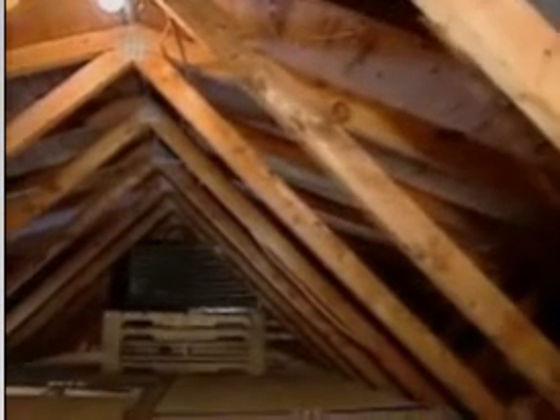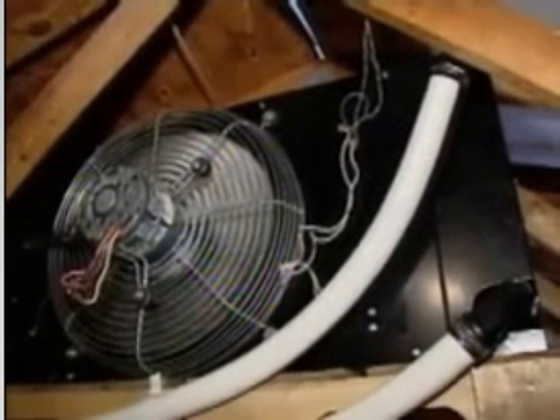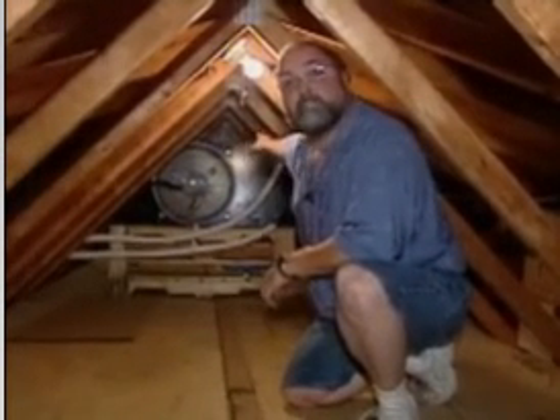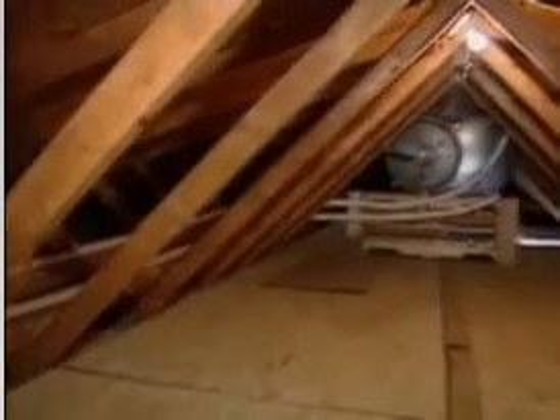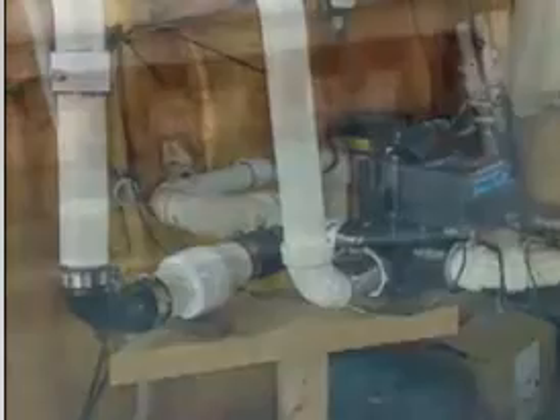So explain to me what the contraption is up in this attic — what does this thing do, how does it work? You're looking at the collecting unit right here. You've got a fan pulling towards us, which is pulling the heat from the other side across the house. It's pulling it through the radiator, which is transferring the heat back to the pool water, which is coming up in these pipes and going back down into the return. It runs off of a five-amp fan, which is probably only about $9 a month. It kind of operates like a car radiator — the water transfers through the radiator, the hot air goes through it, the heat transfer takes place, and then the water comes back down and back into the pool.